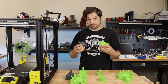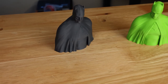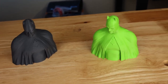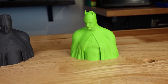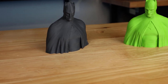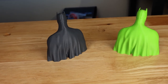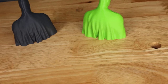Look at the 100 millimeters per second prints on both of these. Oddly enough, the SKR did finish just a little bit quicker than the Lerdge, but given the amount of time we're talking here, it wasn't a whole lot. You're talking about 12 minutes faster for a 4-hour print. Looking at the quality on these, now this is at 100 millimeters per second, you're really going to see what I'm talking about in terms of the amount of processing power that printing this amount of G-code takes, particularly at a high rate of speed. And actually, the Lerdge, I believe, did a little bit better.